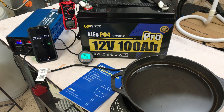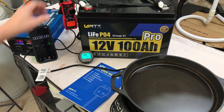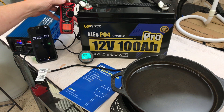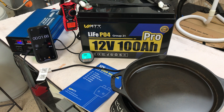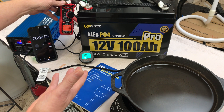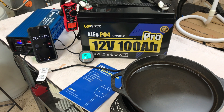Let's get this turned on — we'll just go with medium for starters. I got 94 amps right now. Let's put it on high. That's going to give us 117, 118 amps — roughly right around there. This meter is showing 112 on the shunt. So even if it is a 110 amp BMS, this will be a pretty good test. We'll run it for five minutes and see how it does — see if we can get some water boiling in five minutes.